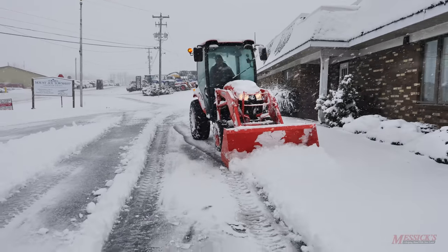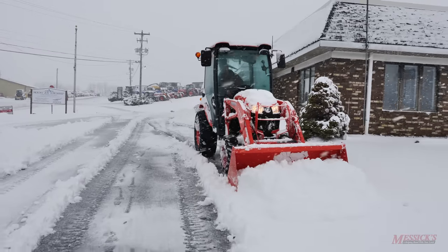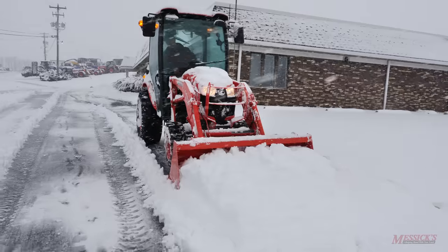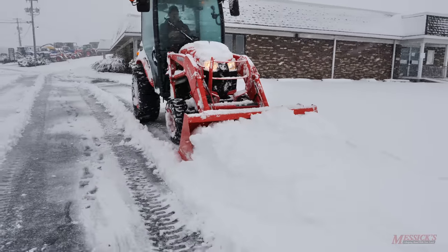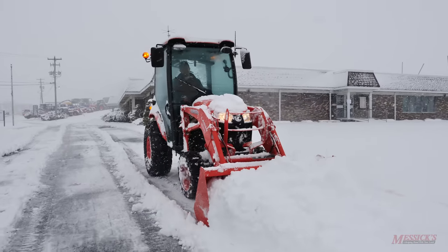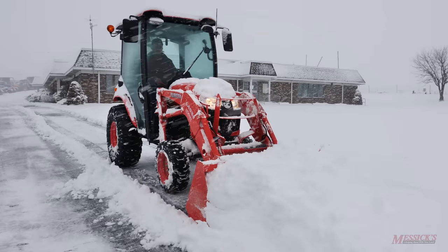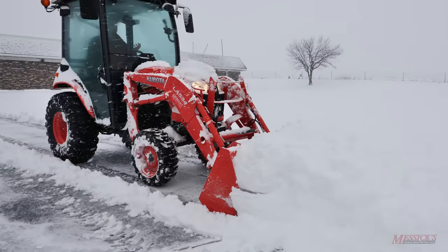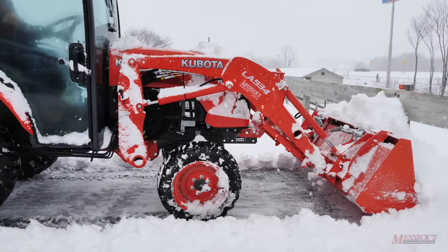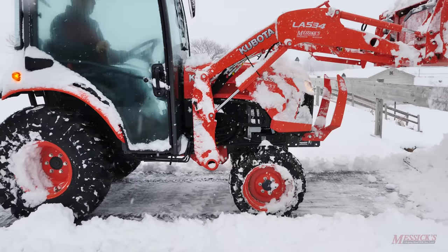Commercial parking lots are one thing, but you don't want to mark up your home driveway. Those push boxes are pretty inexpensive and a nice upgrade over doing it with the bucket. There are also plows you can snap onto your front loader, or belly plows that can go down underneath the tractor. Being able to angle a plow sideways again helps with the dribbles so you don't have to go back and clean up. It just makes it more efficient than pushing in a straight line all the time. The loader is really the best option for guys dealing with light snowfalls every now and then when you can't quite justify spending the additional money for a dedicated snow implement.